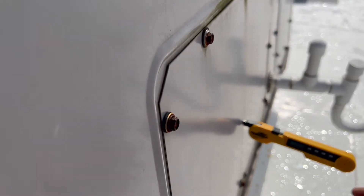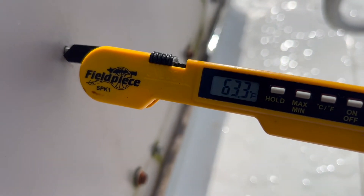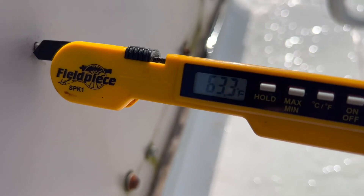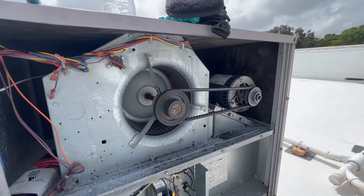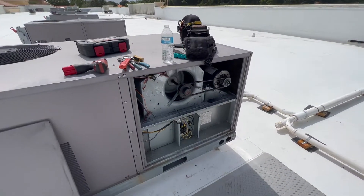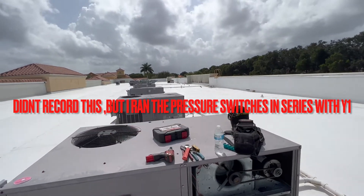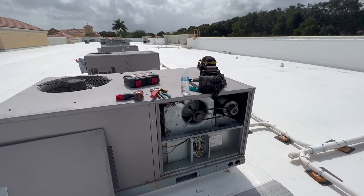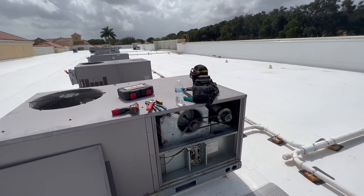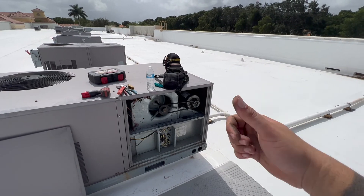That coil has to get wet first. It's a bit humid in there, so the TD is not gonna be perfect, but you can see it's dropping already — it's at 63° and keeps going down. Pretty happy with it, we'll check it later. Just got the belt aligned, so that's way better — she's back in line. Gonna close it up and on to the next one. Thanks for watching, I hope you liked the video. Don't forget to subscribe, like, comment, and see you on the next one!